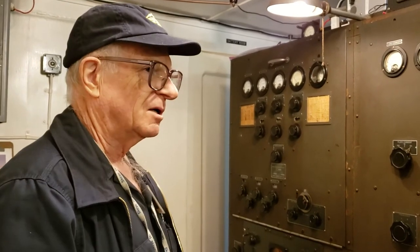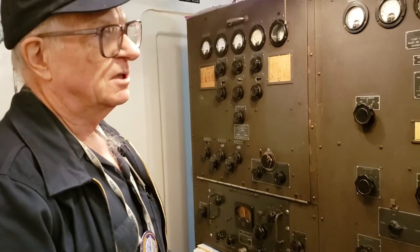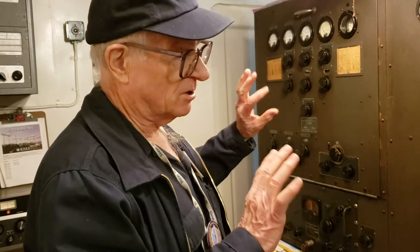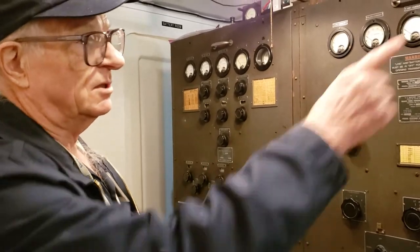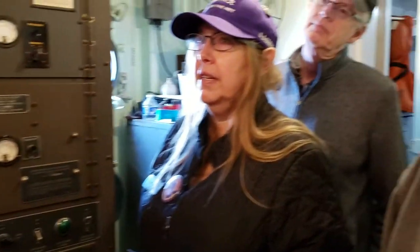And you refurbished these? Yes. We have a spare console, which is in pieces in the hold, so we stripped it for parts. And had to actually use some parts from it because a lot of the parts are standard radio electronic parts, but there are some, like a special transformer and the auto alarm receiver. I thought, well, am I going to have to heat that up, get all the tar out and put a new transformer in the case? But we have one.